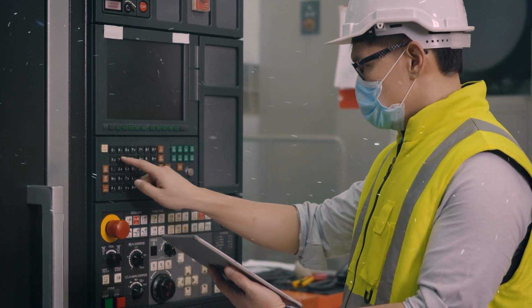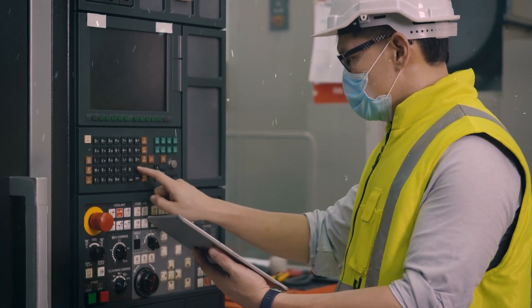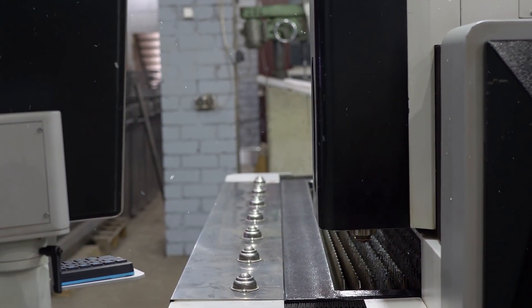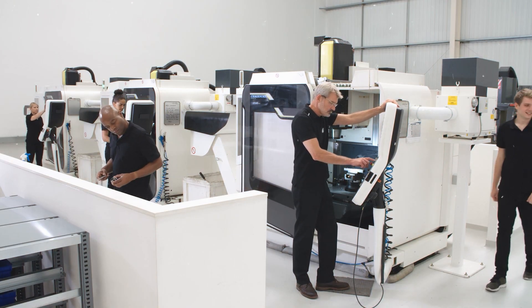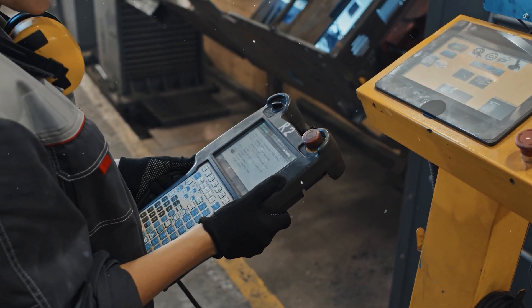One of my favorite things about GRBL is that once you set your machine configuration — things like steps per millimeter, maximum speeds, and direction polarity — it will remember all those settings forever. You don't have to re-enter anything each time you power up your CNC. For support, GRBL also has a huge community behind it, so troubleshooting help is plentiful if you run into any hiccups.